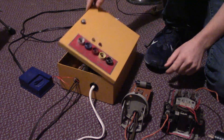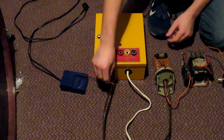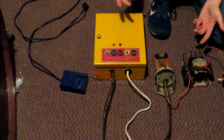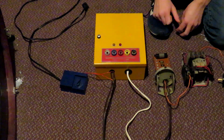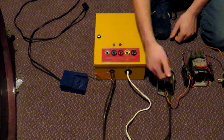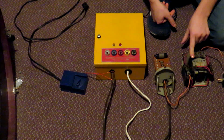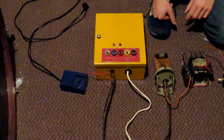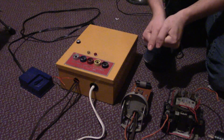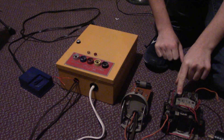So let's say you press alert. The one wire is already going to the ring relay. Once you press alert, it sends the other half — the positive and the negative — since it's running on AC, flickering back 20 times a second at 90 volts AC at 20 hertz. That completes the circuit, allowing the ring relay to engage, then causing the motor starter to engage, activating your siren. Now, these systems are faulty — if at any time those two wires connect and complete the circuit, you're going to cause the ring relay to engage and make the motor starter engage, setting off the sirens in your system.